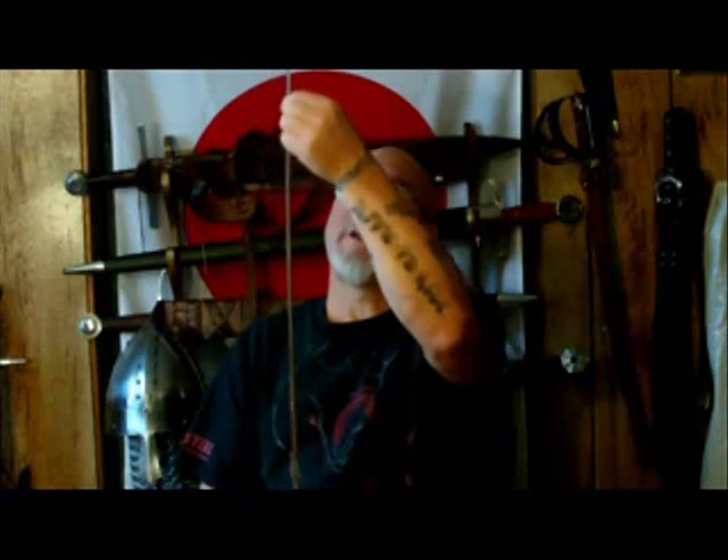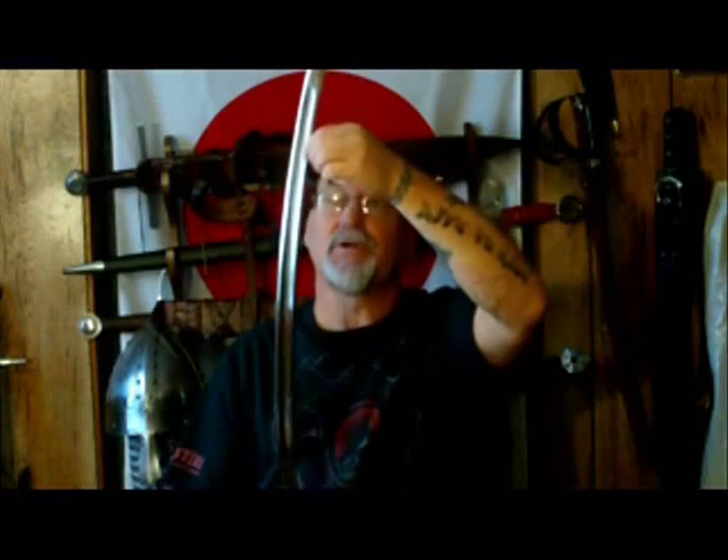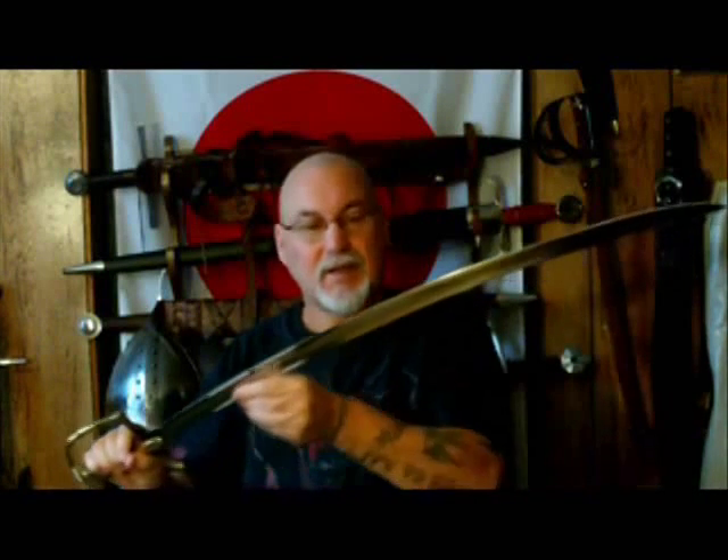This particular saber is quite similar to the other ones I have. It's just a hair under eight millimeters here by the tang, and by the time it gets down to where the blade geometry changes, we're at only four or five millimeters. So there is quite a bit of distal taper — very noticeable and visible, with a nice even taper going all the way down. These swords are not extremely flexible or whippy, but I have flexed and bent a few of them and they won't take a set.